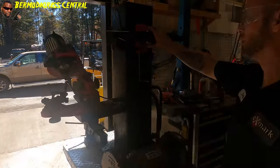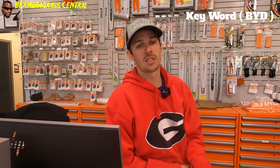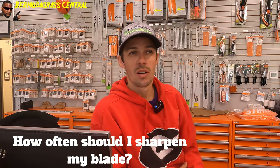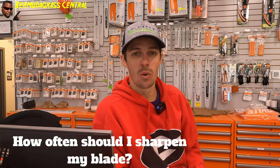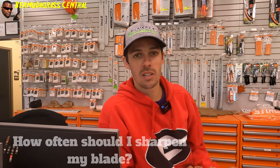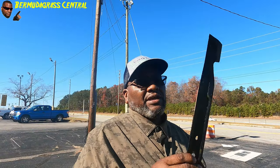The BYD sharpness test — it's pretty sharp guys. How often should I bring it back? It really depends on the size of the yard, but look at your grass — you'll know when it's not cutting as well. About every 20 hours of cutting it needs to be sharpened, and at about 50 hours the blade definitely needs to be replaced. Also take into account where you live: further south toward Florida there's more sand in the soil and it'll take your blades out quicker than in a clay soil like here in Georgia.